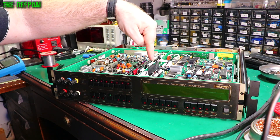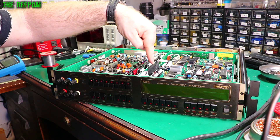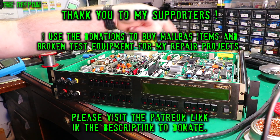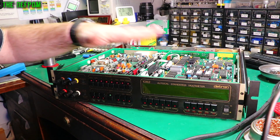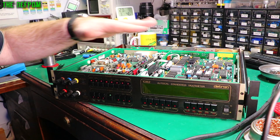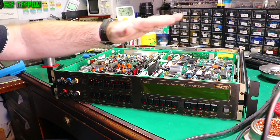Interesting thing — this one has had the battery replaced. It's got something stuck to the side here — wires coming across — they haven't used the proper battery, which is interesting. I'm going to replace that with the proper battery. I'll be careful not to lose the calibration constants, because right now it is kind of calibrated. I haven't actually done that kind of testing on it yet.